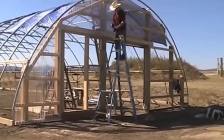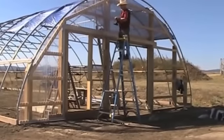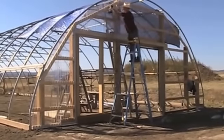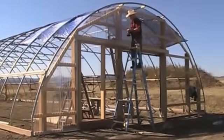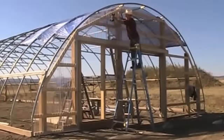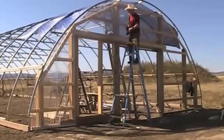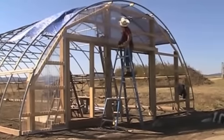This is the end that will look out onto Bear Butte, so when I'm working in the greenhouse I'll be able to see the weather going by on that side. We're doing sheets that are two feet wide and then custom cutting them to the length needed. We got various polycarbonate panels and we're working with eight-foot lengths right now that we're cutting down to size. It also comes in ten-foot and twelve-foot lengths.